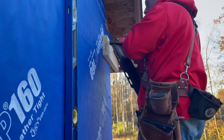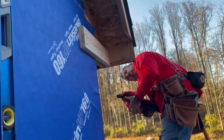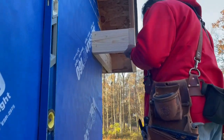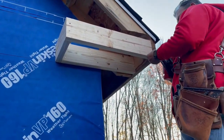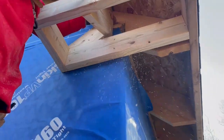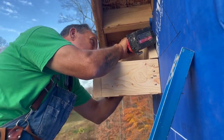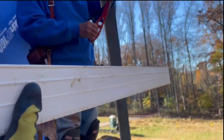In layman's terms, this is an attractive way to kill the two roof lines that connect. This can be challenging because the returns are located outside the corner boards, which means they require additional structural support. There are a ton of ways you can do these, but Smitty started by building a box on the main ridge roof line, then applied mini rafters with the same pitch as the main roof. Once complete, he sheathed the box.